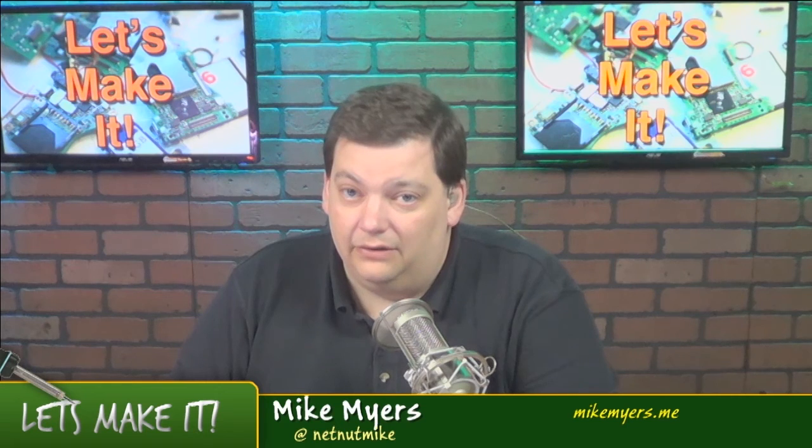But I can tell you that all the Adafruit stuff always works well. It's very well documented and very well put together. So if Adafruit has one, it'll work just fine. In fact, the libraries I got were from Adafruit originally because somebody said that they do work, and then they weren't working quite right. So I started looking around a little more and found this other person who had modified the Adafruit libraries to work with this, because it is very similar, but not exactly. There's a couple of pin differences, from what I understand, that were messing some things up.